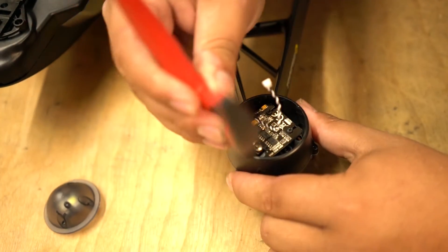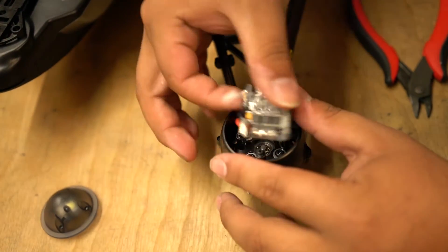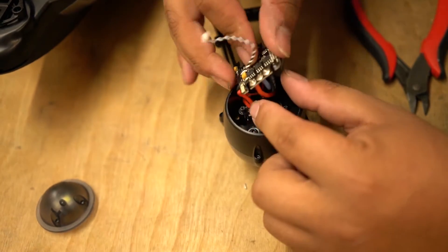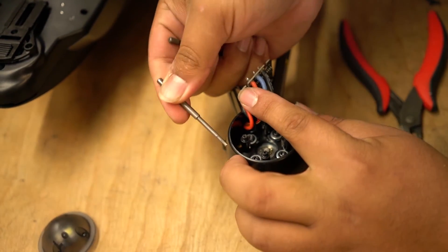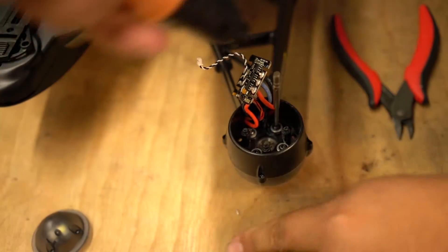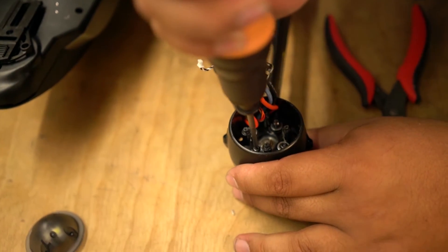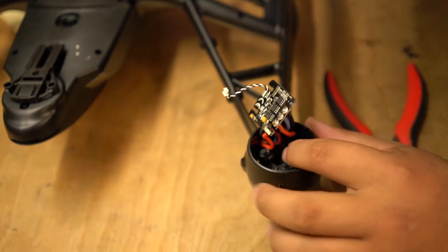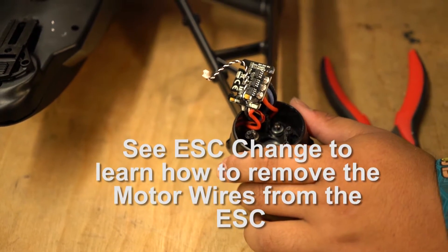What we are going to do is pull up any tool that you need — sometimes I like to use dikes, sometimes phillips drivers, but whatever it takes to pry this up. Pop this off, disconnect the signal wire, and we are going to use a 2mm driver to pull out the motor mount bolts. Note they have washers — you want to keep those on. You don't want to pull the bolts all the way out. Get that loosened and then get your soldering iron ready.